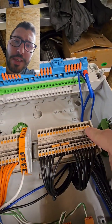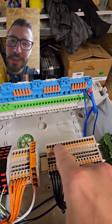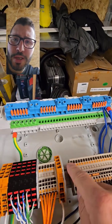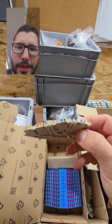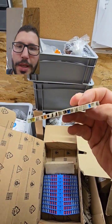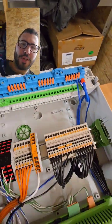Then I have the high voltage side here, which is using just the phase — so 230 volts in Austria — and the neutral and the protective earth are taken from here. Typically I use other clamps when I build cabinets like these, where the neutral and the PE is on the clamp as well, but as this cabinet came with it, I took the cheaper clamps for the customer.